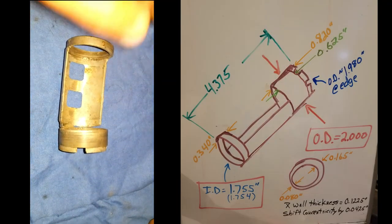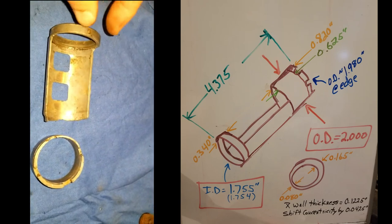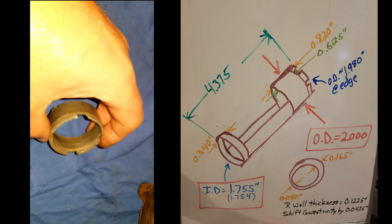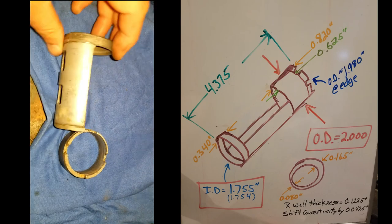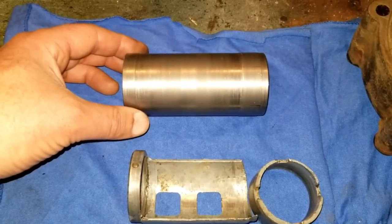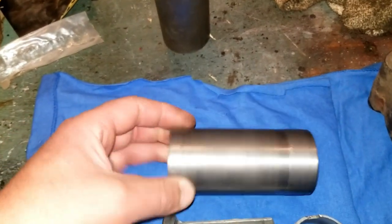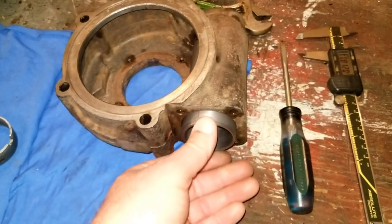And of course, this is the other beast that I'm in the middle of making. So, like I said, that's non-concentric there, and the bearing races are held out here, in here, and there's these notches here, and then this portion here is a little bit less diameter, I guess, if you will, than where these bearing races are held. Again, off camera, I have done the lathe work on this piece here. You can see it's non-concentric, and it's not obvious, but there's some differences in diameter across here, just like this one is, and they match up pretty good. And this thing here fits into this piece like it should.